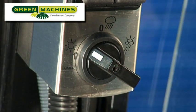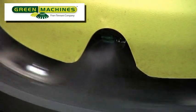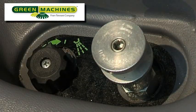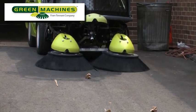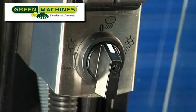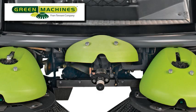With the switch in the one position, the water pump is activated and water is supplied to the cloud maker, the spray jets above each brush, and the jet in the suction tube. The amount of water going to the brush jets is regulated by the operator using the valve located in the cab on the left-hand side of the seat. If the valve is turned completely off, the flow to the brush spray jets will be off, but the flow to the cloud maker will continue. It is important to use sufficient water to control dust, but also important to conserve water and prevent turning the debris into mud. Turning the water system switch to position 2 will run the water pump and only supply water to the suction tube jet and the brush jets. The cloud maker still rotates to allow self-cleaning and prevent dirt buildup when it is not being used.